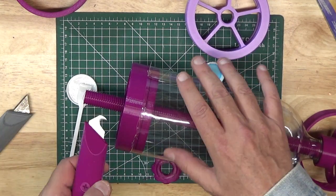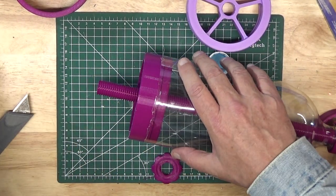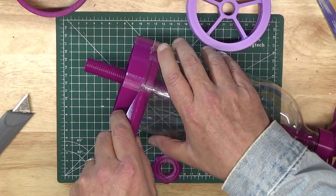Now, we're ready to cut — but for safety's sake, please don't use a regular utility knife blade for this purpose. Without practice, it's fairly easy for the knife to slip out of the groove and for you to unintentionally drag the blade into some part of your body — and trust the voice of experience, that is going to hurt. What you want to use are curved utility knife blades, often called roofing blades or linoleum blades. While not eliminating the risk of cuts, they are certainly a lot safer to work with.